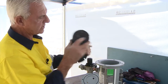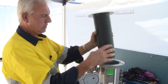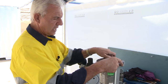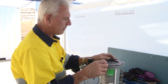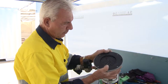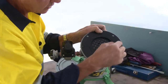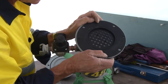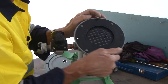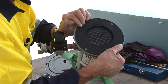The new filter cartridge should make a little shaking sound when handled — that shows the coalescing filter hasn't been exposed to the elements and is ready to go back in. To line it up, look around the flange until the four bolts line up. Just ensure they are lining up nice and square. If you're not happy with that, turn it around until they line up appropriately.